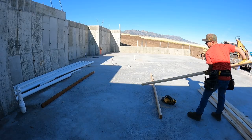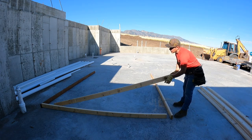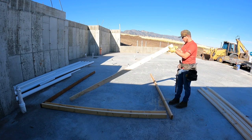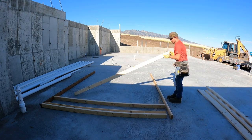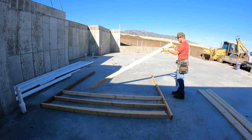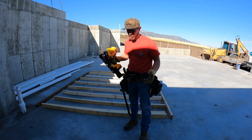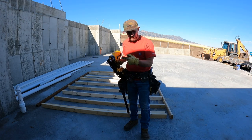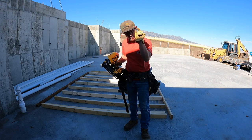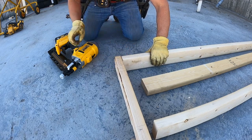It is time to start laying out our studs to our wall. I know I'm going to be tipping it up this way, so I'm going to lay it out that way. And if you don't know, you should always crown your studs and crown them up, so the entire wall always faces the same way. Luckily these have very little crown in them because they're still pretty fresh and haven't sat long. Now we can actually start nailing. You definitely need to watch where your hand placement is — about a month ago I shanked a nail in a top plate, it curled up and came into my thumb. Hurts like a mother, still.